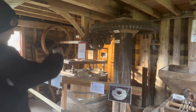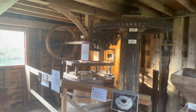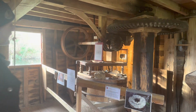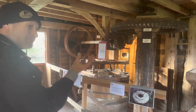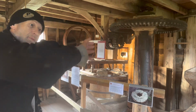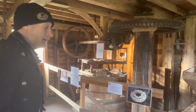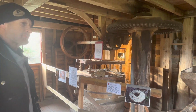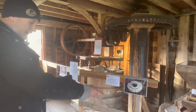Yeah. We had a problem with one of these bearings recently. It kept almost sticking, and then carrying on again, and we couldn't work it out. And it was just the bearing in there, it was just getting a little bit worn, a little bit sitting to one side. So I had 10 minutes with a bit of sandpaper to even the bearing out and readjust it to where it should be. Because I guess you can't really pop down to home base and get a new bearing. Everything's got to be made. Yeah, we had to get a new bearing made for down there.